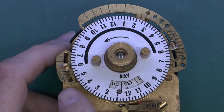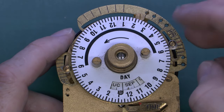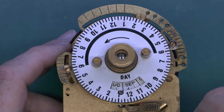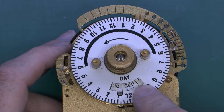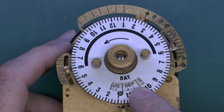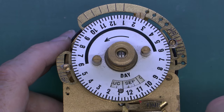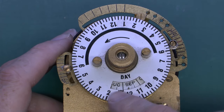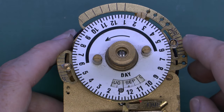This particular timer is designed to switch lighting on and off, and hence it only has a single on and off per day. So we've got the on over here and then the off over the other side. Again it's a 24 hour thing - purely turn the lights on when it gets dark and turn them off when it gets light. This is really why it's got this month selection in the middle, because depending on the time of year the time that it gets dark and light will obviously vary. You need to then adjust the time, so this has got a mechanism inside so that depending on the month set it actually automatically adjusts the on and off times.